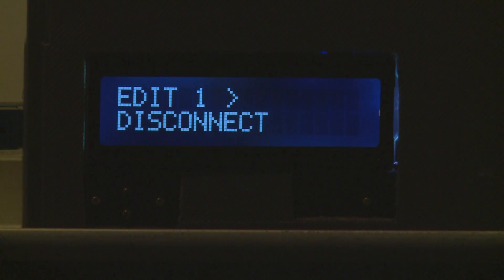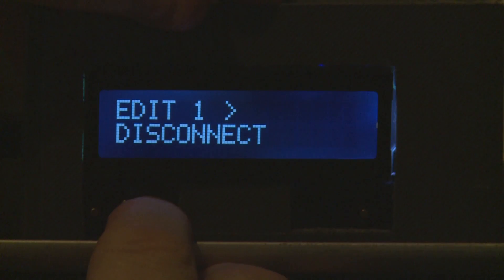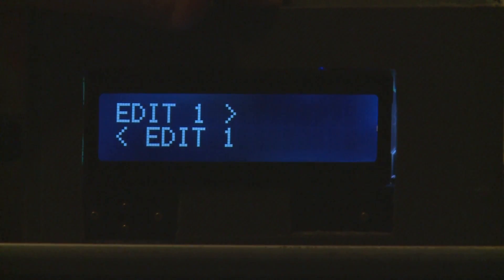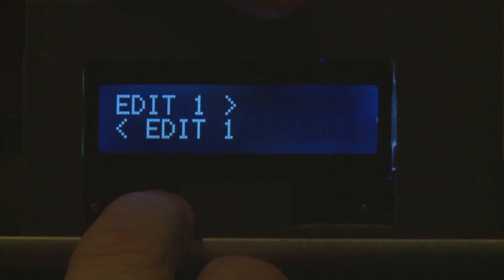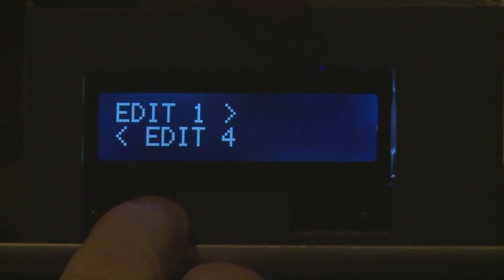Deck controls are always deferred — never instantaneous as cross points can be. That's because a deck control actually changes two items: every time you change anything on a deck control it selects the source and then the destination, so it has to be deferred in case you hit the wrong button. As you browse sources, if the source also shows a left hand arrow it means that selection is also a controller — making it incompatible with the destination.